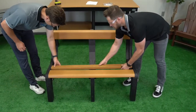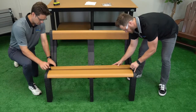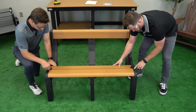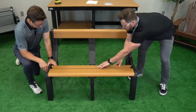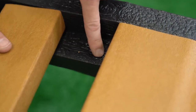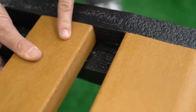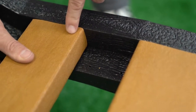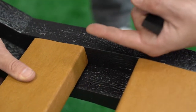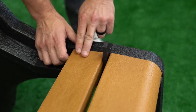Now place a seat slat on the seat. Using the narrow width of your 3-1/8 inch spacers to provide separation from the leading edge seat slat, slide the seat slat tightly against the spacers. Note that there are pre-drilled holes underneath the supports for each slat. It is possible the pre-drilled holes do not perfectly align with the corresponding location on the slat. Move the slat back and forth to see the alignment. If you notice that alignment is off, be prepared to angle the screw slightly to ensure it screws securely into the slat.